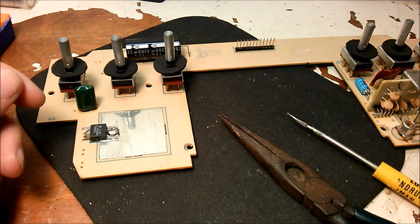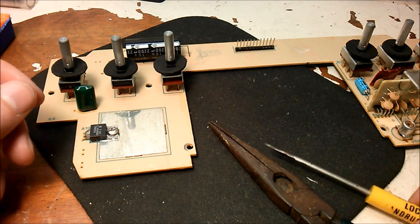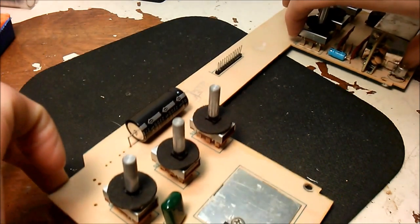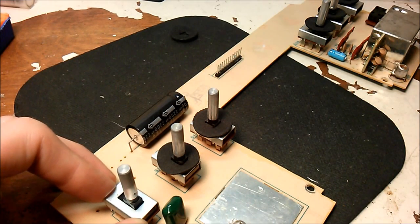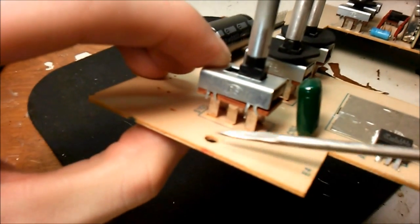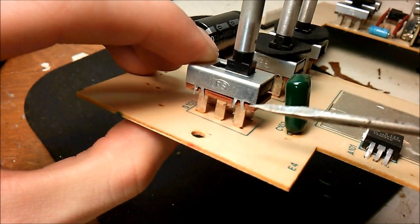There's no easy way to clean these switches but it's got to be done. You'll need a pair of needle nose pliers and an awl or precision screwdriver — just something small to poke with. Starting with the power switch: remove the little foam glide protector, and then the four little tabs — two on each side — that hold the switch body on need to be bent outwards with the pliers. Be careful because they're slightly spring-loaded. When you bend them out, the body comes off.